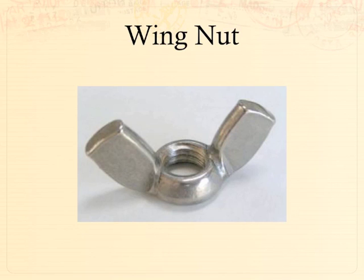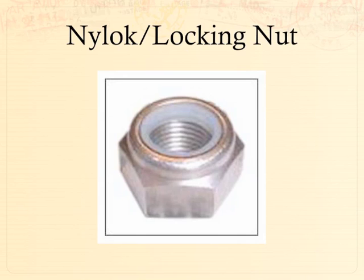A wing nut, also sometimes called a finger nut, is tightened only with your fingers — that's why it has those two little Mickey Mouse tabby things on the sides. There are no tools made for tightening a wing nut. A nylock nut, or locking nut, has the same hexagonal shape as a hex nut but at the top there's an added piece of nylon in a dome enclosure. As you thread the nut onto a bolt, the nylon cuts to the same thread pitch as the bolt, creating a friction surface so the nut won't come off through vibration or agitation.